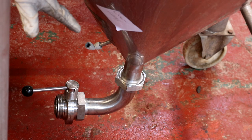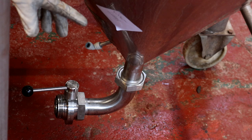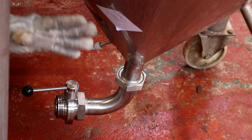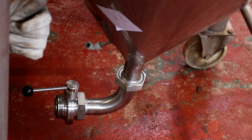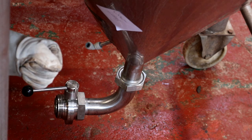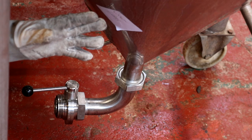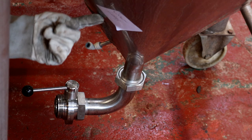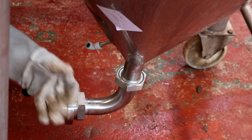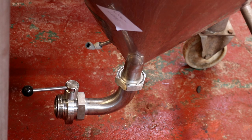Fingers crossed, folks. This will be the last patch on the tanks - all the rest of them are done now. Then all I have to do is cut off the cooling jacket on the other tank - you know the one where it's too high up - and then re-weld that one on, but that should be pretty easy because I can pull the amperage down and hopefully just flow her in without too much of a problem. The steel on the main tank is 3mm thick, so if I'm welding 0.8mm onto 3mm my amperage will be low enough not to scorch through the 3mm and cause coking on the inside. Looks promising - the proof of the pudding as they say is in the bacon, let's get on with it.